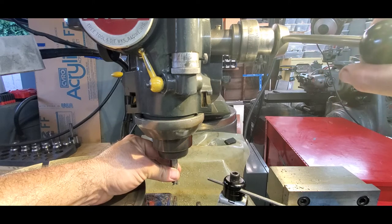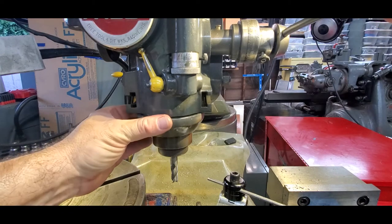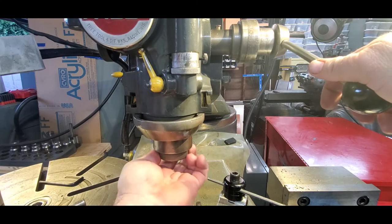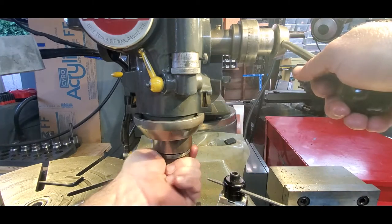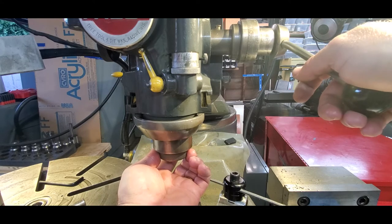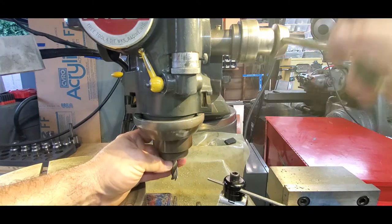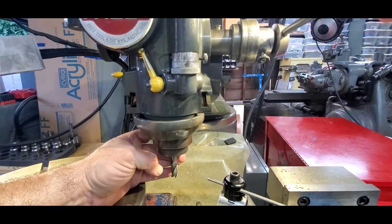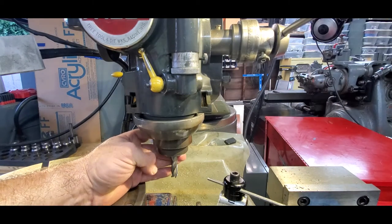Put the tool in and close the collet. Close the yoke. To change to a different tool: open the yoke, pull the handle down, that opens the collet, tool's out. Take the nose off, put a different collet in, close it up tight. Pull the handle down, back it off a little bit, put your tool in, close the collet. That doesn't have much resistance so I'm going to tighten it a little — that's pretty good right there, you can hear it. You don't want to go over center too much — that's closed pretty good, once it's closed, done.